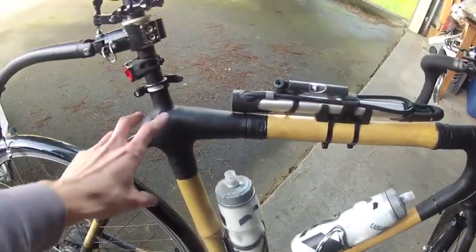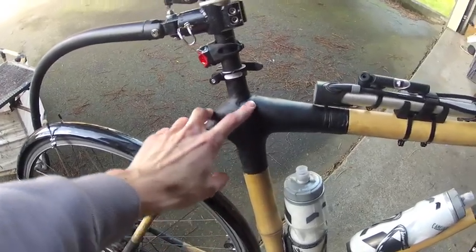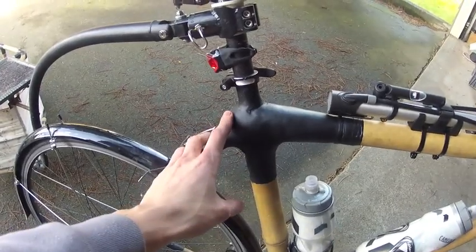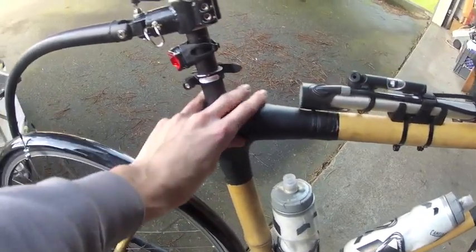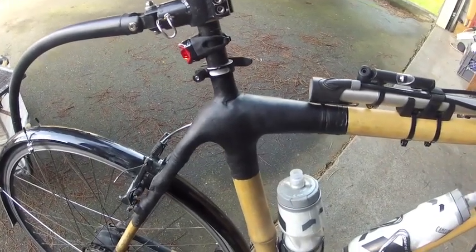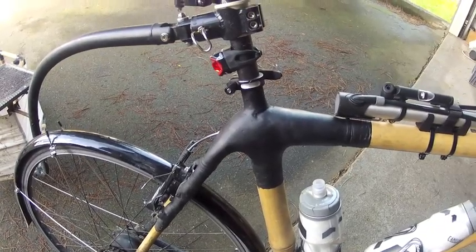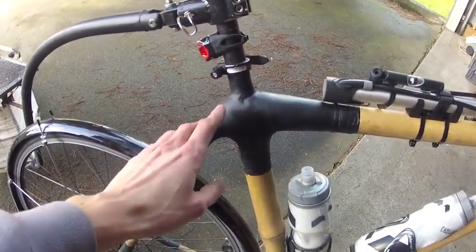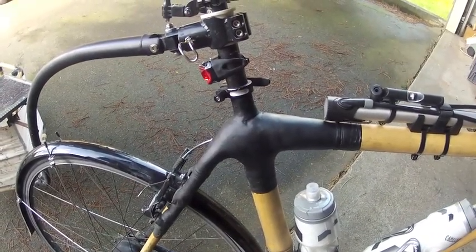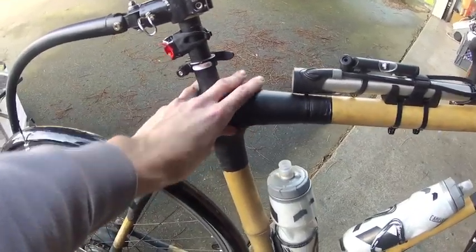I get asked a ton: what are these joints? It's a mixture — there's fiberglass at the very bottom, but the main shaping and substance is carbon fiber and resin. We take 24k stranded carbon fiber tow — something you can get on eBay — and wrap it with a two-to-one epoxy. That's how we shape the joints.